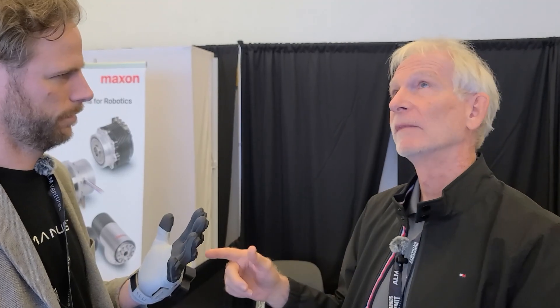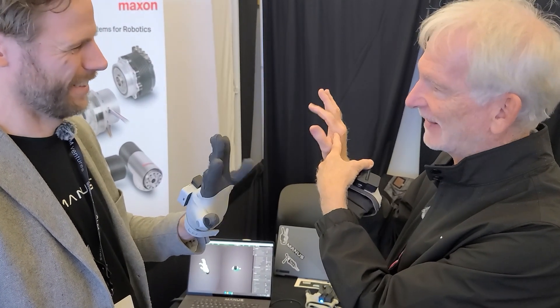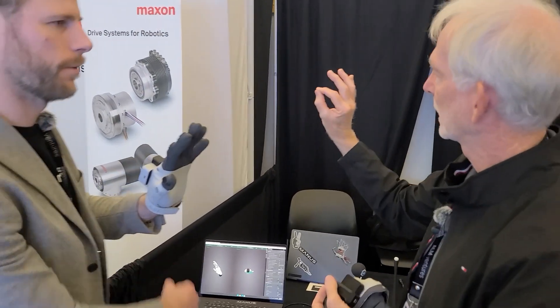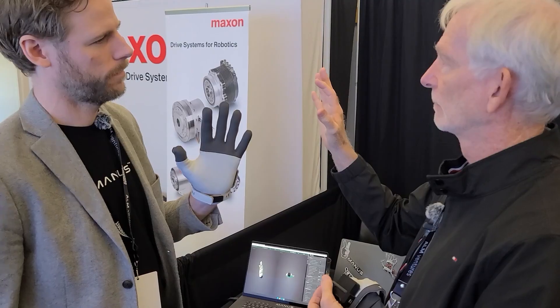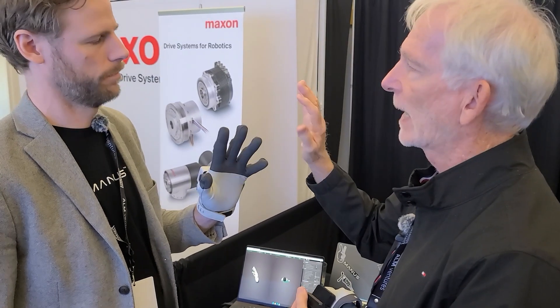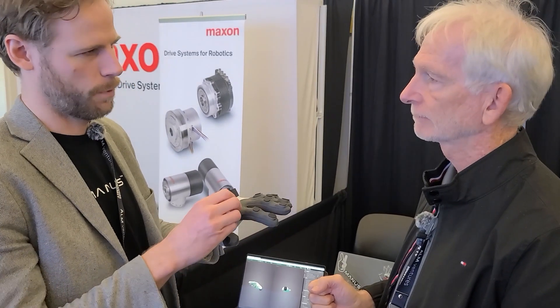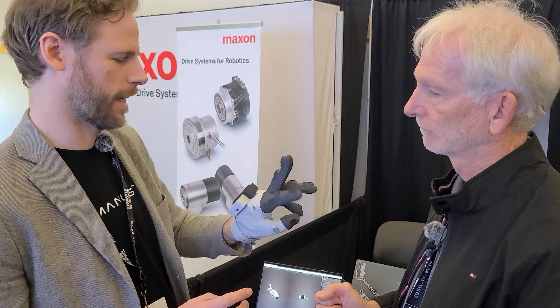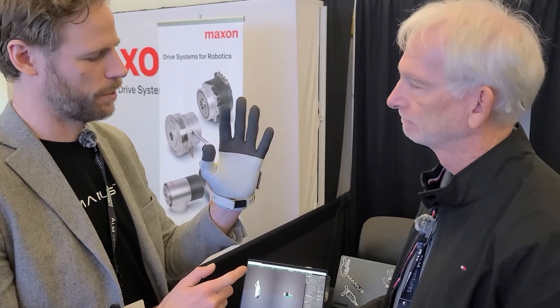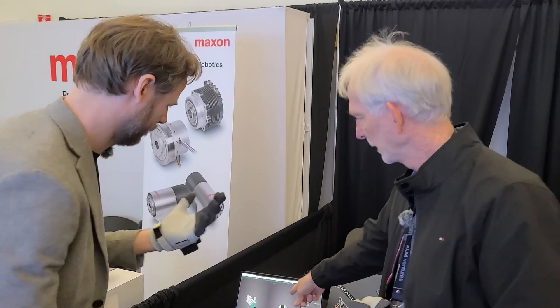It's like a four-degree-of-freedom robot if you could do standard kinematics — two joints down here, or a third degree of freedom at the knuckle. You're more or less looking at the point in space, and the orientation plays into the inverse kinematics as well. We use quaternions on every single joint — representation in 3D space — so you can also get the twisting rotation for the metacarpal bones. Especially the thumb — that's on a full rotary joint as well. From that we can get really accurate motion tracking.